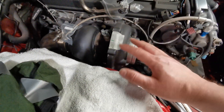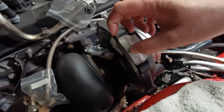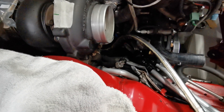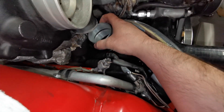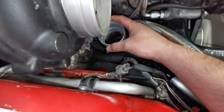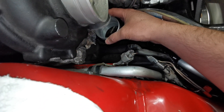I've replaced the compressor cover to see the clocking — this is the old mark I did, so we're already a bit off, but since we don't have that elongated pipe that should be fine. If we place this V-band somewhere around here, the power steering lines in the middle of the picture are limiting the movement downward, so having it something like this should be fine.